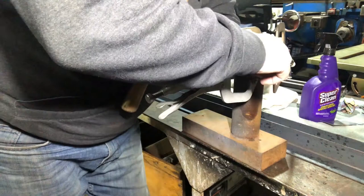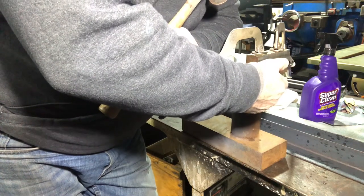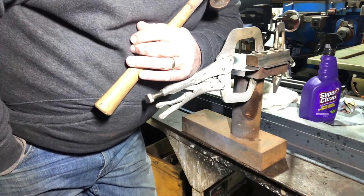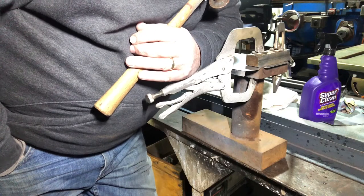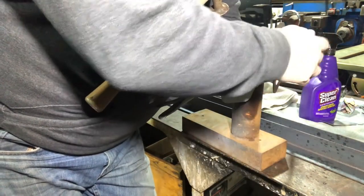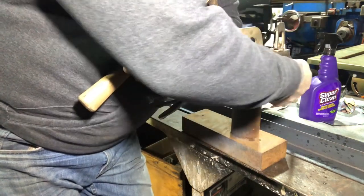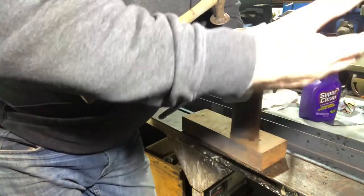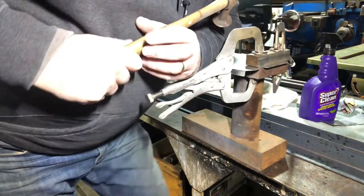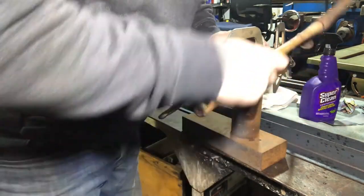I'm going to do this last down-standing flange. I'm doing the hammer forming on this anvil that I built when I was an apprentice. They said you should build yourself an anvil — I'm like, what for? That's when they knew I was only an apprentice. But it's got perfectly 90-degree sides on it, so I could line this flange up right against the side of the anvil. This line lines up perfectly with this end, so I know I have 90 degrees. I wanted this flange to be 90 degrees to both sides. I'm just using a flat piece of stock as my hold-down and the anvil as my hammer form.